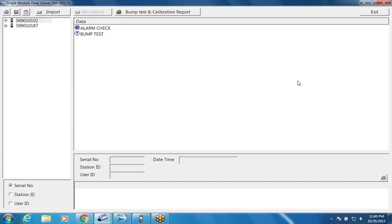Gotcha. Thanks. Hey, Bruce. So there's two different styles: a master and then the ones that you can daisy chain together? They're all the same. No, they're all the same physically and electrically. It's just that when you have them daisy chained together, they act a little bit differently because there's only one master. Like in this setup where we've got two of them connected together, there's no connection to the outside world from anything past the first unit. All the connection is done between the two units automatically. So you only connect to the first unit, even if you've got 10 units set up.